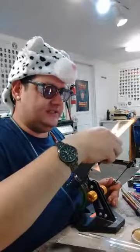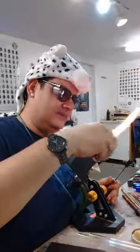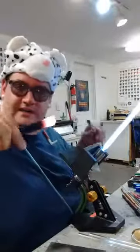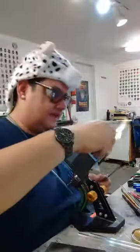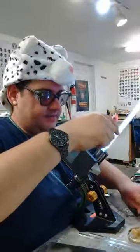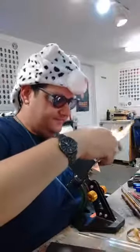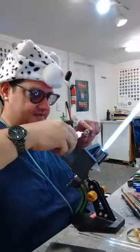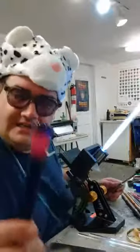But I find that getting the glass pretty hot, hotter than it needs to be, and then letting it cool, like now it's cooling. Now I'm going to put my tool in there. Once this tool gets a little bit warm and has a little bit of beeswax on it, I love this tool. It really works good. It's a brass 14 millimeter male joint forming tool, and look at that, bam, that sucker is there. The idea is to have the right taper. That's the whole idea.